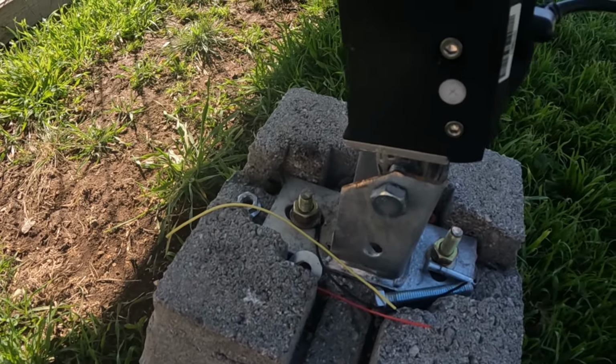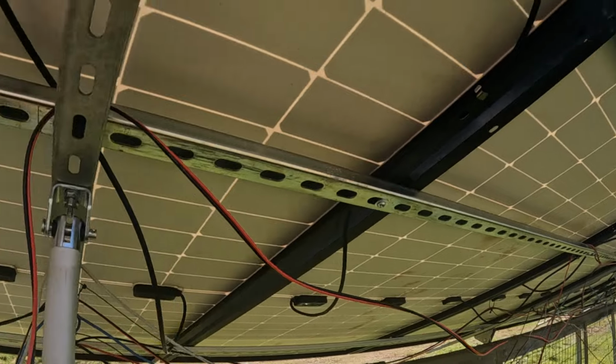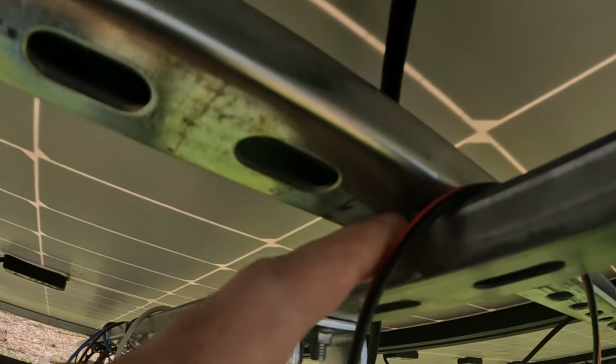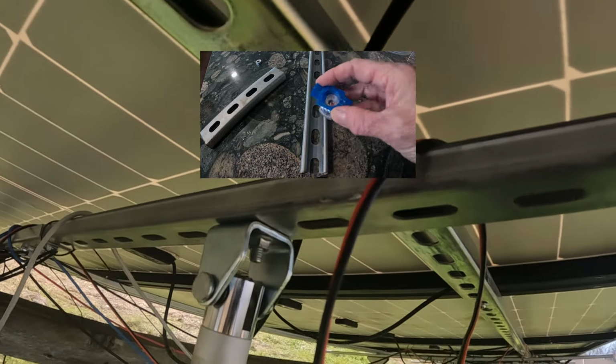And then you build the scaffolding, and this kit came with, we had to actually order 2 kits. So one kit can do about half the panels, and they're set for 4 panels. And we made it stretch, and then also ordered some additional 10-foot sections of unistrut from a home improvement store. And then they all attach to each other with, you can't see it in there, but there's a mount that this goes to, the little plastic piece that it sets in. I'll show some pictures of those up close.